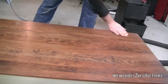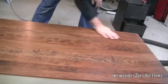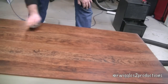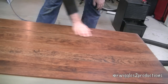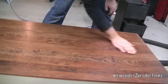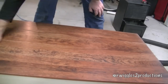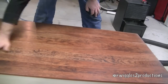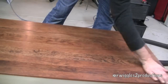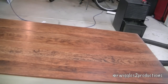Now that we have our final third coat of water-based polyurethane, we're just using some 4-0 steel wool and doing a nice final pass — nothing hard. We're just going lightly to take out any air bubbles or nubs and make the surface glass smooth, and then we'll be done and ready to take this upstairs. We'll be able to put cocktails on top of it and not worry about any spills or alcohol burning through the finish.